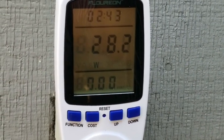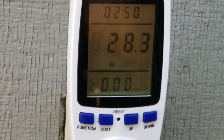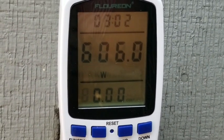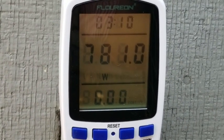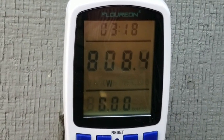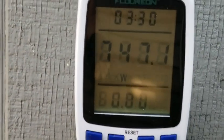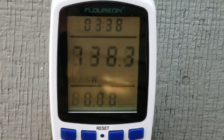32 watts — this is how many watts it's taking at the moment. And 28. The outdoor unit has not kicked on yet, but it will — it takes a little bit. There it is, it's kicking on. Not bad at all. 800 watts, then going back down. 747. 738.